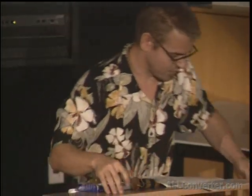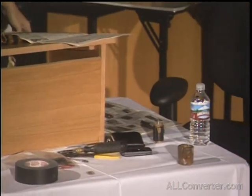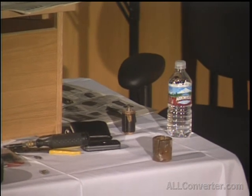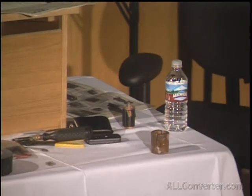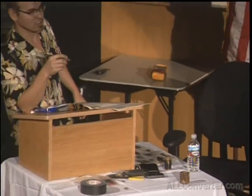And if you operate it off of a 480 line, or a 500 volts line, as I think Tesla said here, it becomes even more interesting, because technically a 480 line you can use to run a Tesla coil direct. You don't need a transformer. You need the spark gap to be very close, maybe 1 or 2 thousandths max, and it's hard to quench the gap at that kind of voltage, because at 500 volts, instead of dealing with milliamps in the secondary, you're dealing with amps of current.